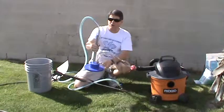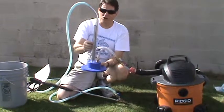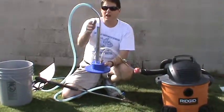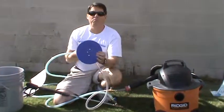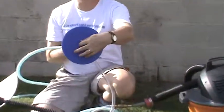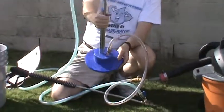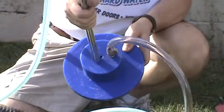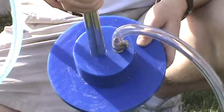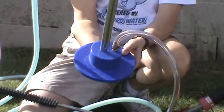The next component of the media carburetor is the stake and the draw tube. This stake right here seats into the media carburetor and is fastened onto it by some bolts underneath. What's nice about this is when you tighten up this bolt here, it allows you to have some flexibility and control over the stake. It's very important when directing the air to make sure that the stake lines up with the air hole, and you can do that by tightening up that nut.